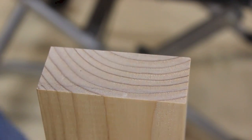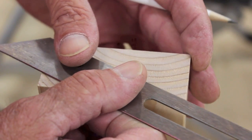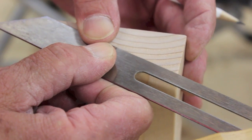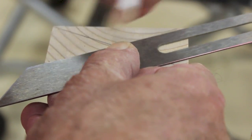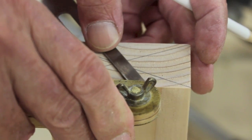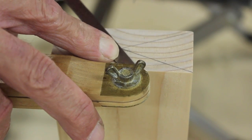With a reasonably square piece of wood, what I want to do is rip it at a 35-degree angle, and I'd like my rip to be pretty much exactly in the middle of this piece of wood so that I can get two pieces out of it. The way to do that is to draw a line from corner to corner on the board, which will give you the center point, and then with your bevel angle set at 35 degrees, move it until it intersects that crossed point in the middle — and this will be the cut line.